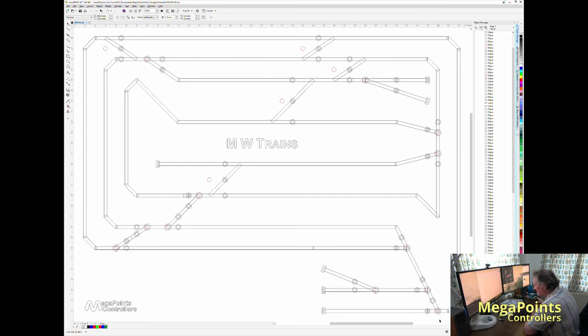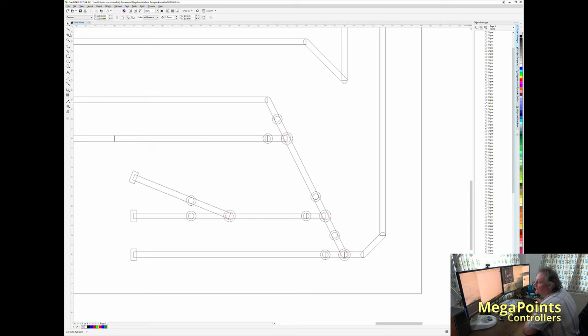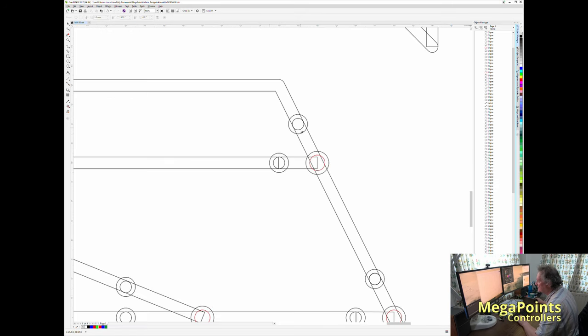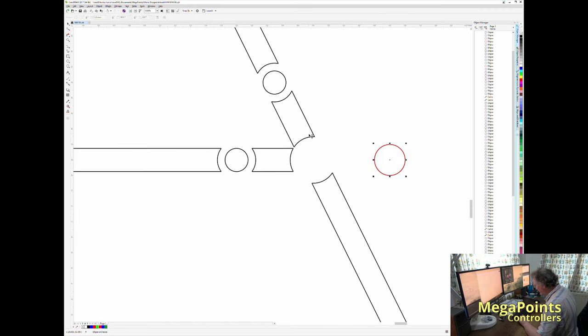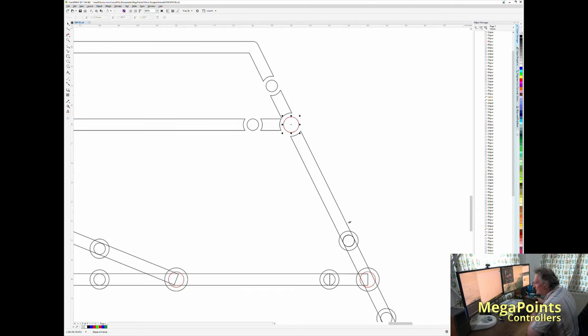Okay. All right. Let's start in the bottom corner here. And we'll get the cutting tool. Don't need that line. Clean that up. Clean this up. Moving out of the way, clear out the perimeter, put it back. And this is rinse and repeat for everything now. That can go. See that little bit there? That's enough to cause the laser to do something silly. Each vector has to be fully enclosed. So the whole thing here, this whole road, if it's not fully enclosed with no spurious lines, it won't engrave it properly.